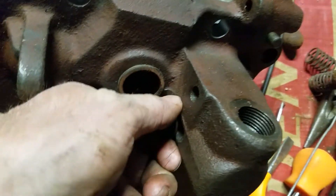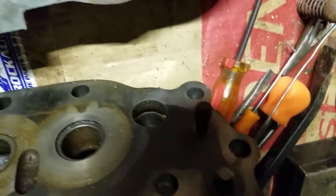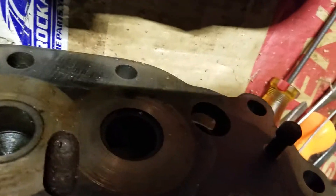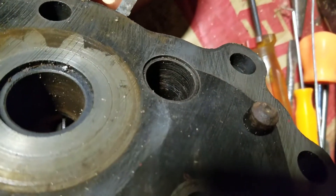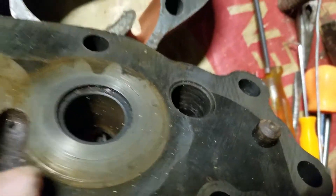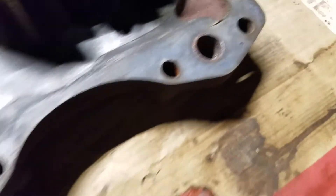When you pull the lever and raise this pin here — or actually it'll push it down. When you pull the lever it'll push that pin down, close that slide right in there. There's a port over there. And as you pull the lever, it lifts this, moves this pin, lifts that tube up, which forces all the oil up against the relief valve, and since it can't go out the relief valve right away, it comes across, goes down through the check valves, and out to your ports.